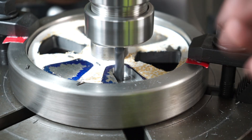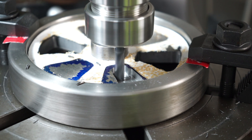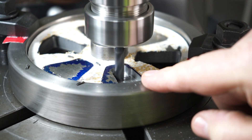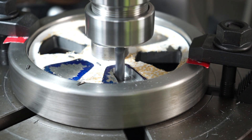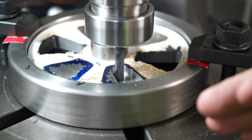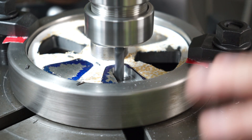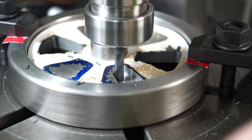I've indexed the flywheel around 180 degrees. I filmed this pocket being performed — I'm doing it in two passes, dropping down six mil and cleaning that pocket up, then dropping down to 12 mil for a full cleanup, and then I'll do the contour around the wall.